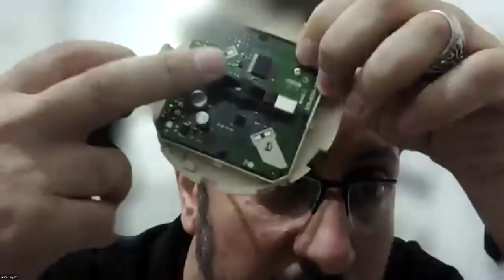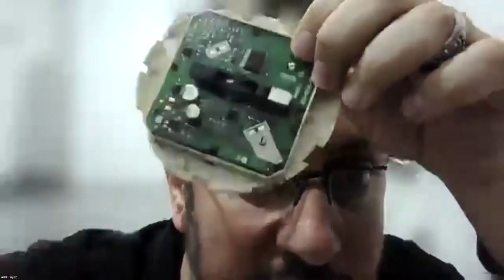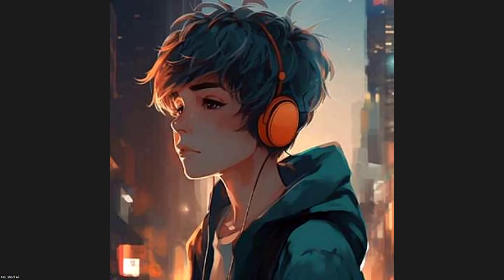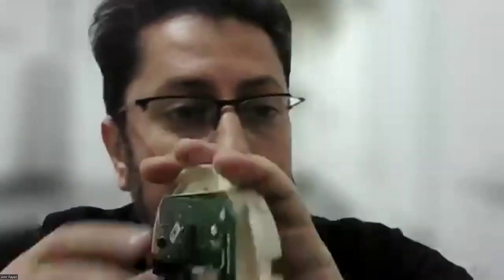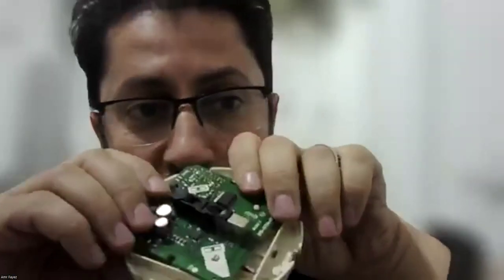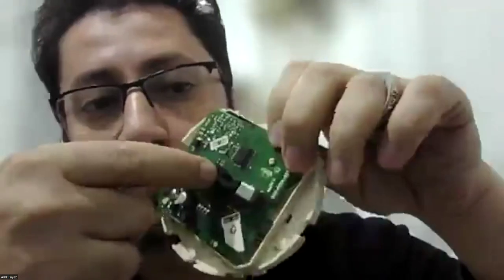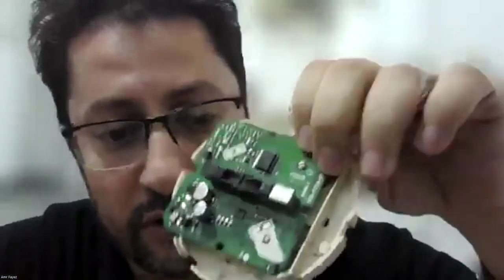Now it is clear. Now I have a photoelectric cell and a reflector like a mirror. When there is any fire, any smoke, any dust, any vapor, water vapor or moisture, it will cut the signal between the light and the reflector.